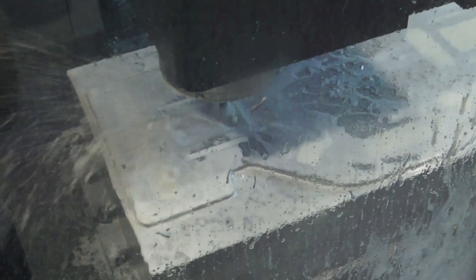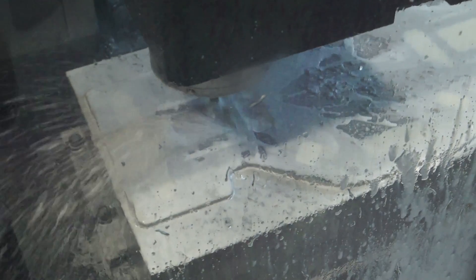But the benefits of using HyperMill on 3-axis machining — is it quicker to programme offline than online? It's still quicker to machine offline, certainly. We're able to do more analysing on the stock conditions of the part, so we know where we've been roughing and we can trim toolpaths back to the absolute minimum so there's no air cutting. So it's about optimisation as well — making sure that you get the best cycle times and less tool wear?